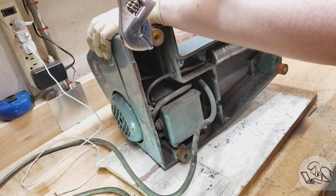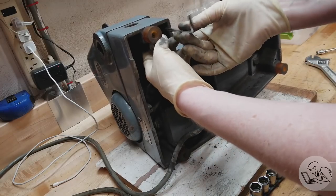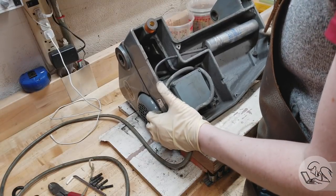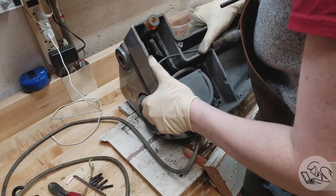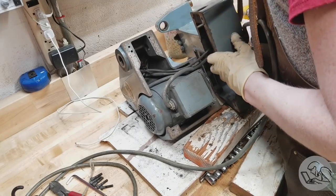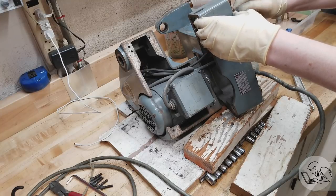I'll remember that Loctite makes sense — everything here is vibrating because this is a grinder after all. I'll get those little nuts out as well. With some persuasion and some praying to Metallicor, the machining gods, the parts do finally separate. This is where I learned that those little nuts were just holding alignment pins in place, which makes sense. The alignment of these castings is actually critical because the main bar goes through both castings — one end in the lower casting, the other in the upper — so their alignment is pretty critical.